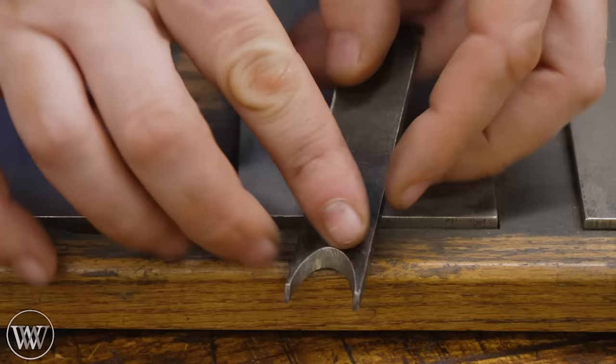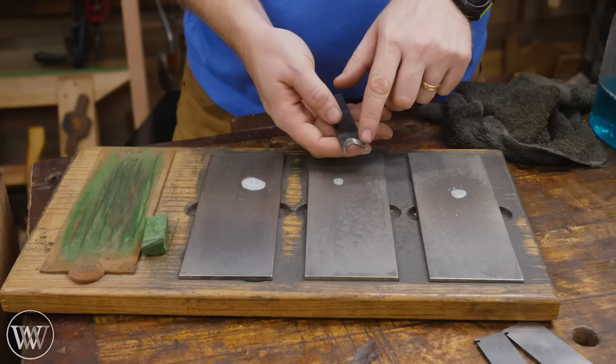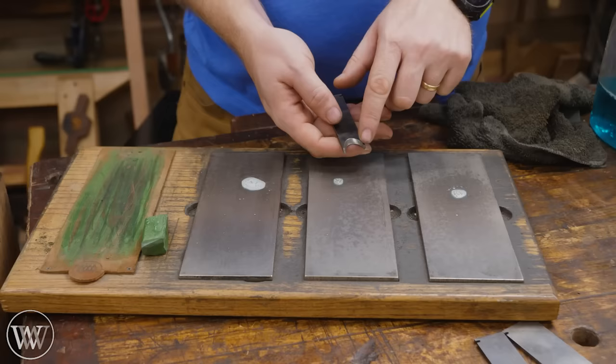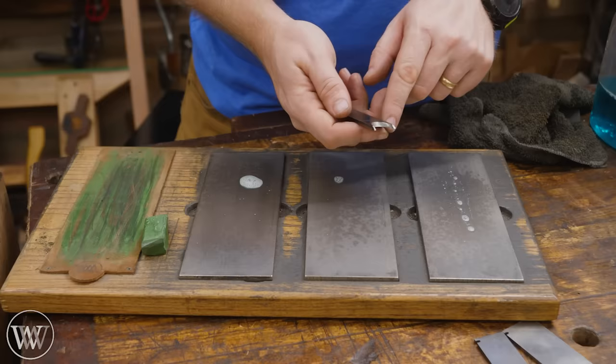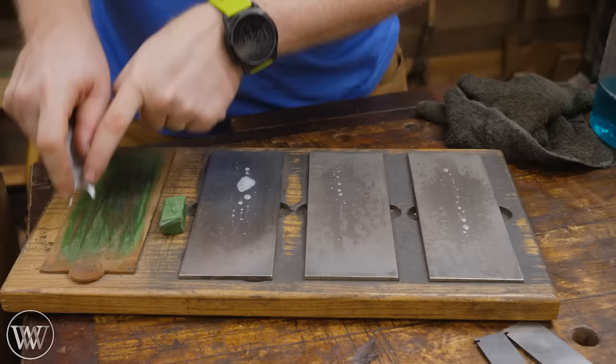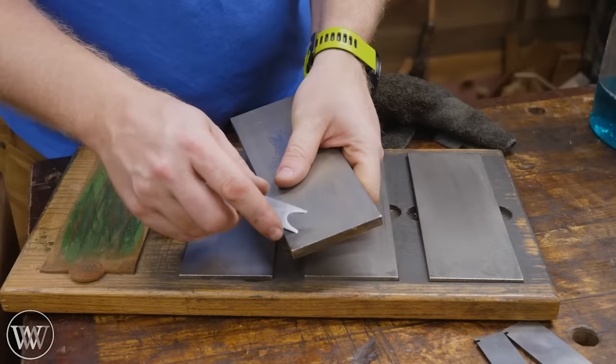Now for this beading cutter, this one's a little bit different. This one actually has two flats and a concave surface, so you want to make sure you're hitting both the flats and the concave surface. We're going to do this in two parts — the flats first. One of the problems is I don't want to overdo them; I don't want to take those surfaces down faster than the center point. So I'm not going to do as much to them — they're very small pieces and they don't take much. Just coarse, medium, fine. Flip it over, move the burr, take it over to the strop, and a couple of strops. Those points are ready to go.